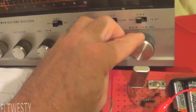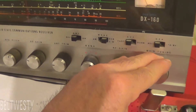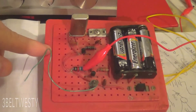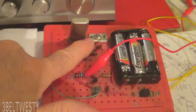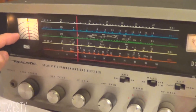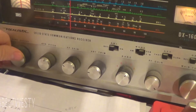You can hear it on this DX-160 — it's at 5.1 megahertz, 5.2 megahertz. What this does is put out a harmonic every hundred kilohertz. You turn it on, and it puts a marker — you line it up with WWV at 5 megahertz, zero beat it with this little trimmer cap, and then you can use this to line your band spread. You can count over the blips: 5.3, 5.4 — each blip is 100 kHz apart.